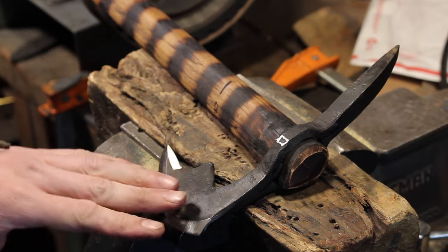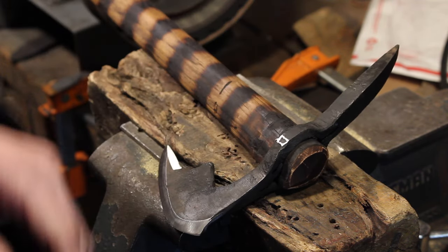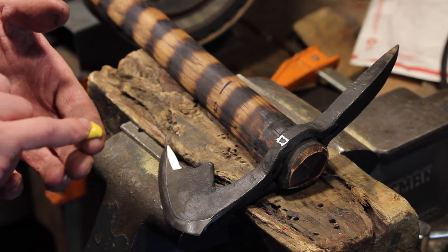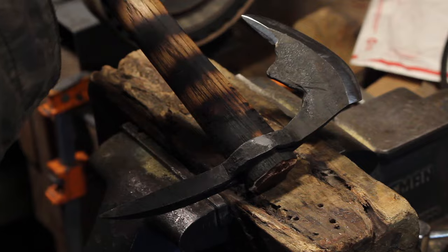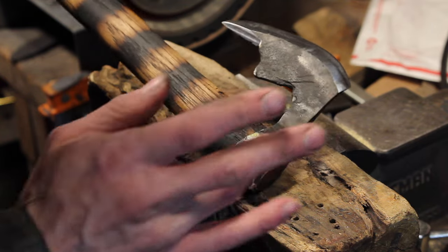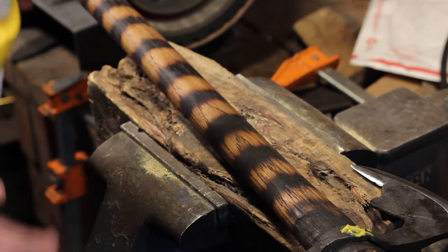Doing the grind, I had a couple of times where I went a little too shallow and brushed the head, so I've got this big shiny spot on the rest of our black tomahawk head. There's not really a way of putting that back. If I had walnuts I'd try some walnut juice on there, but what I do have is some mustard. So we're just going to do a little mustard patina here so we don't have that bright white steel showing - I got it pretty bad on this other side too. It's going to have kind of a yellow color to it, but it's better than bright white steel. We'll also get some linseed oil on this and let it all dry.